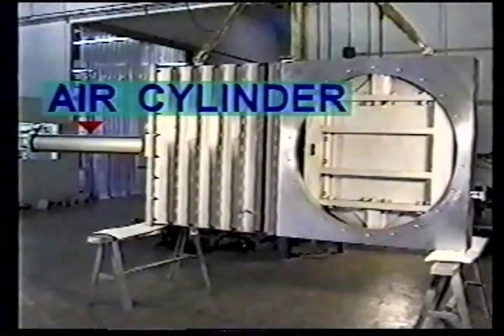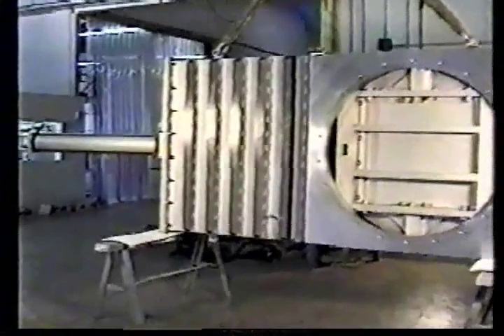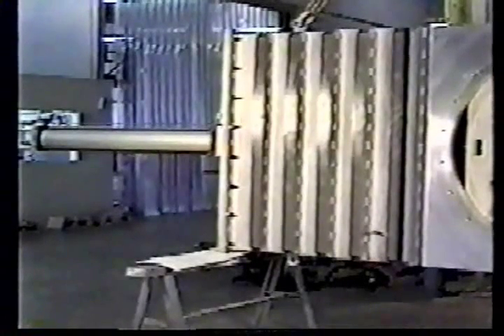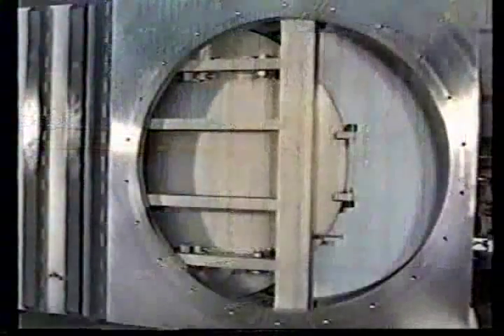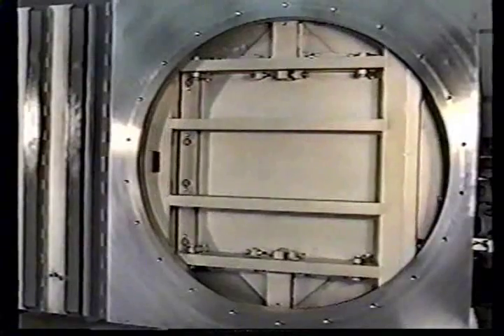Air cylinder: the air cylinder is the driving force for the valve. The cylinder housing must remain free from dents, as any deformation to the air cylinder housing will cause the cylinder to malfunction. The air cylinder shaft must remain free from scratches. The shaft is a ground and polished surface. The seals within the cylinder and the seal in the seal block assembly can be effective only if the shaft is maintained in good condition. The shaft must never be allowed to be bent.